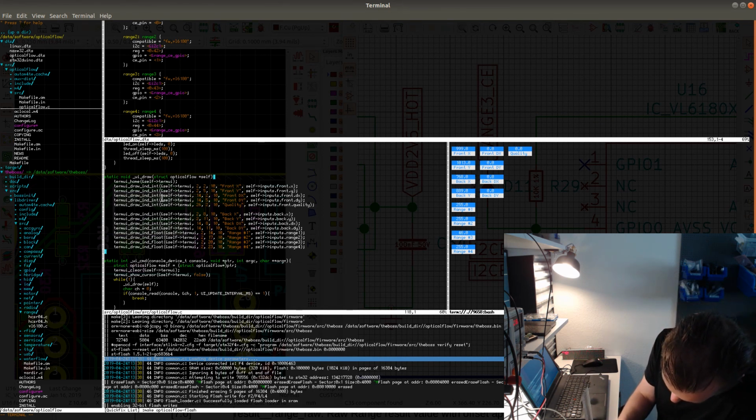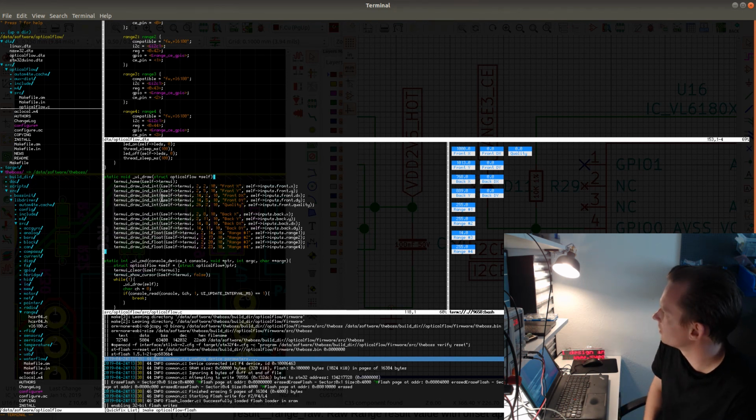This is a reflective surface. So let's see. Place it at 40 millimeters. It reads 49. If I place it at 60 millimeters, then it reads 60. Interesting. If I place it at 10 millimeters, it reads 20. So there is a bit of discrepancy in the way, and there is quite a lot of variation as well. So I'm holding the tweezers pretty still here. And it goes anywhere between 15 and 20.